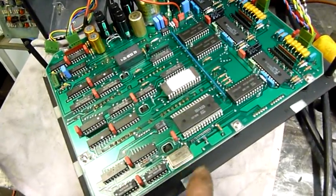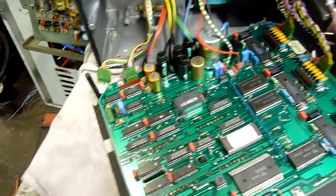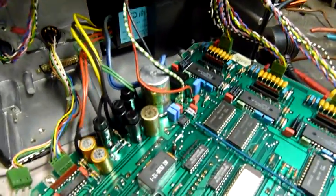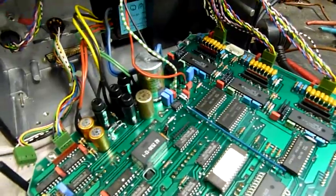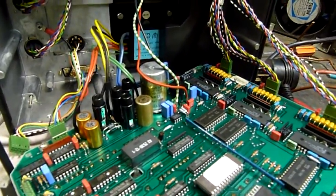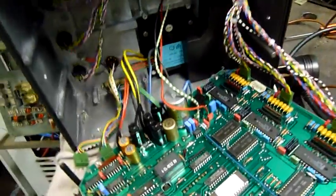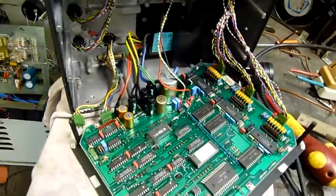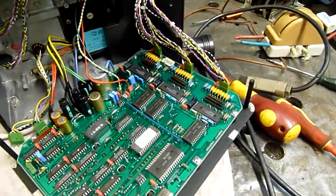Crystal there. What's that cap called? FRAKO — F-R-A-K-O. West Germany. 4700µF, 16V. And I'll bet you it's still got really low ESR. I'm not going to pull it out and test it but I'll bet it's still good, as with a lot of this old vintage electronics.